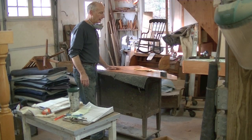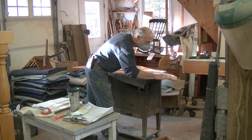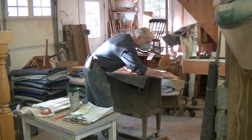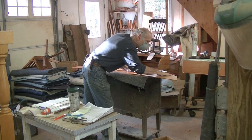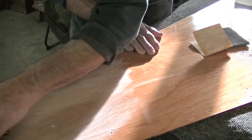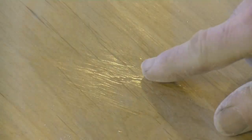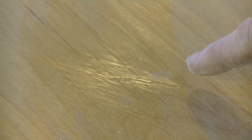Now the second coat has dried overnight. The next step is to sand it out with 500-grit gold sandpaper. The shellac coat has a lot of defects — a lot of brush marks. Shellac dries so fast it makes it difficult to brush a really nice coat over a large surface. So hopefully I'll be able to smooth it all out with this 500. I'm not applying a lot of pressure, just lightly, but I can see the brush marks and other defects going right out. After the first couple passes of sandpaper you can see very clearly the defects — the brush marks — and so I just keep sanding. And now I know it's ready for the next step.